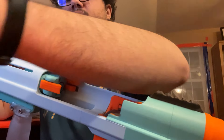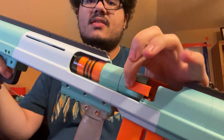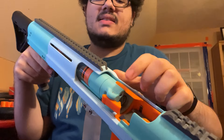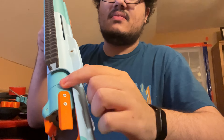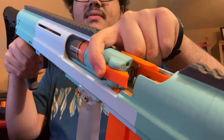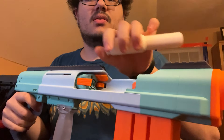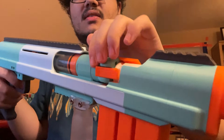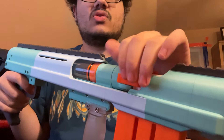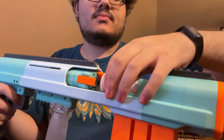I have a separate video showing loading and unloading of this blaster. The extractor and ejector and all that stuff has been improved. This is the shell stabilizer up here, which has been improved in printing — it prints a lot nicer. The extractor, which is this guy here, has been improved and now has a nice big button to disengage it. That's for if you have a longer super extra shell loaded, so you can put it in and then hit this button to not extract it when priming back the blaster — useful if you want to troubleshoot or leave a bottlenose shell in so you can single load darts into the back. It's a nice option to have.